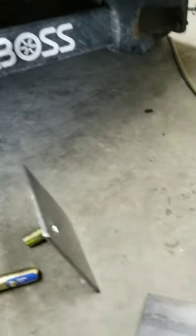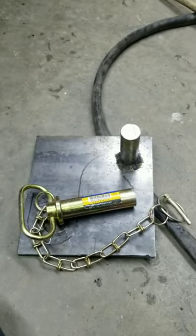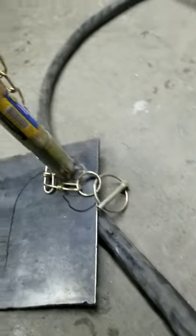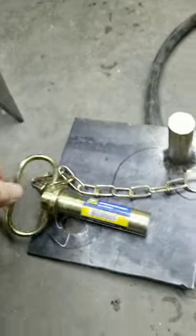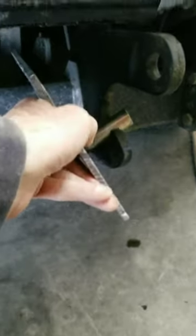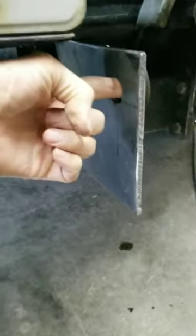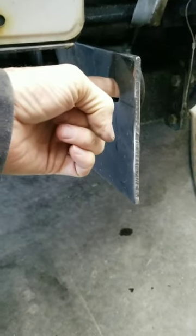I bought these pins at Princess Auto — they're one inch diameter pins. It was one pin and I cut three inches off, and I've welded it to the back location point. How these are going to go in is actually pretty slick. If you look at the plow bracket, that back pin goes in there, this goes here, and the other pin goes through here to lock it in place.